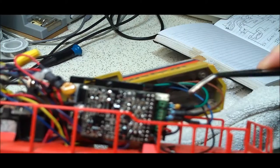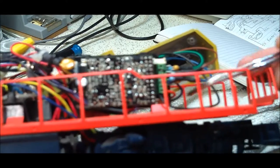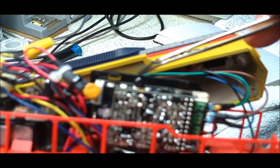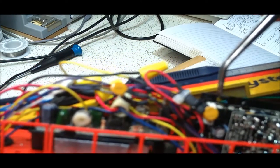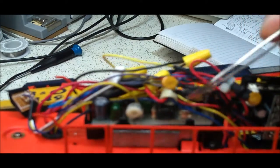So two bypass capacitors, resistors — these are half-watt 820 ohm resistors. I also have the Program 1 switch, and this black wire is the antenna. I was able to mount this board in the factory spot; I just used a screw to snug it in there. I have PTCs connected with the hot lead coming in and then to each one of the motor legs going out.